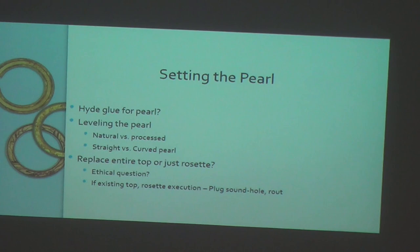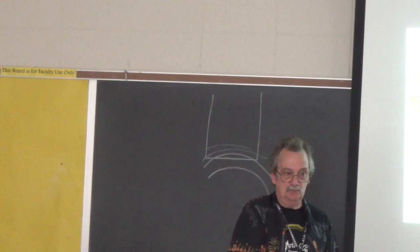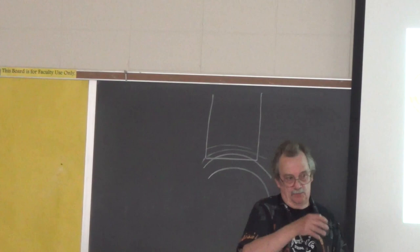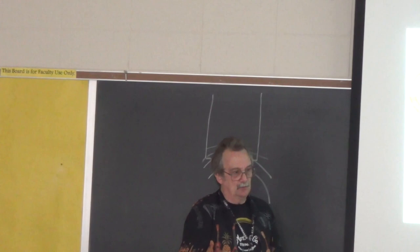The Zipflex, does anybody here not know what Zipflex is? Okay, with the Zipflex, you've got to be very tight on your tolerance. Abalone, you don't have to. I have a note there about straight and curved pearl. You can buy pearl that's pre-shaped, but what I don't like about it is you get a lot of butt joints, and those butt joints are a straight line, and your eye will pick that up. So you like to have the irregularity at the joint from the break.